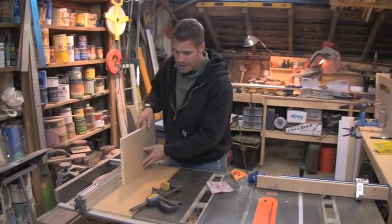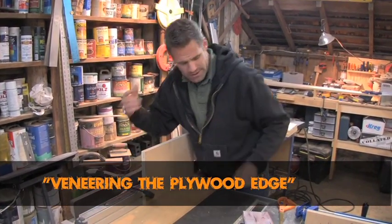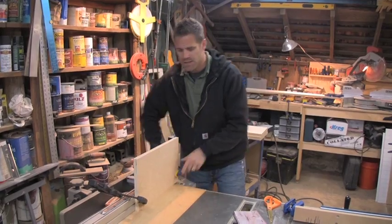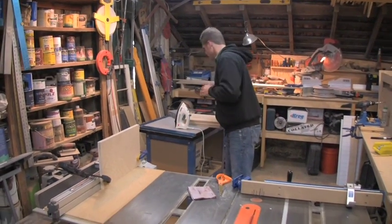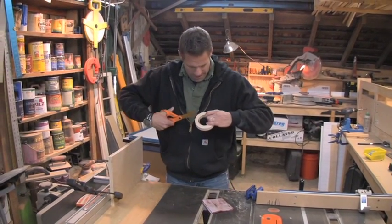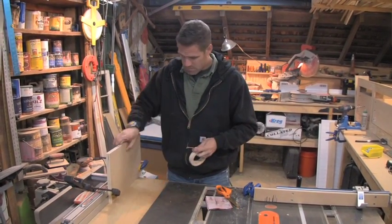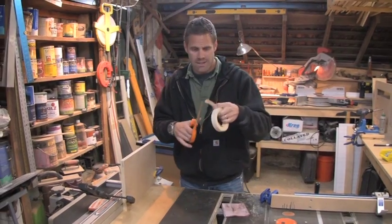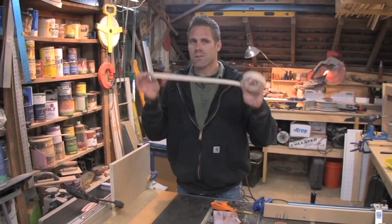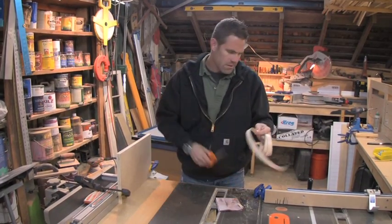All of our drawers are cut to size and now we're going to fancy up the top — veneer the top of the plywood because this exposed edge doesn't look very pretty or finished. To do that, we're going to use this iron-on veneer strip. It's already got the glue on it and it's the same exact species as our plywood, which is birch. You buy this, cut off one end, cut it to a rough length so it's a little bit longer than needed.